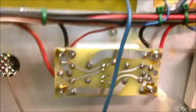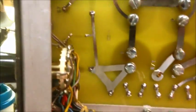Okay, we're off the phone now, but let me show you a few things that we did here. This is the soft start unit from Harbaugh, all wired up. New capacitor board, all new capacitors, rectifier diodes, resistors. I know I'm not showing the top side — I'm not going to go back through and take all the screws out of the cage.